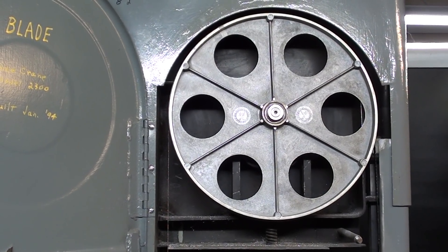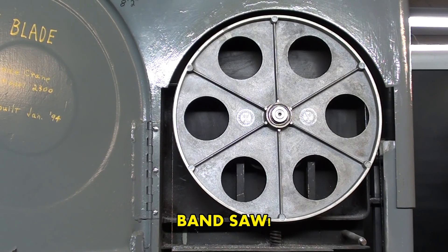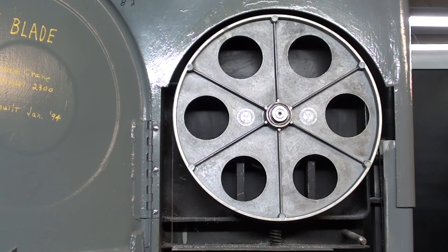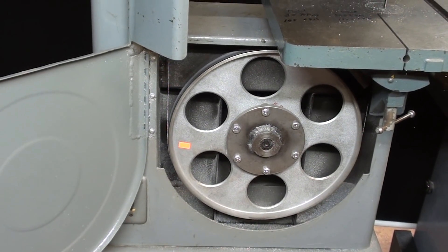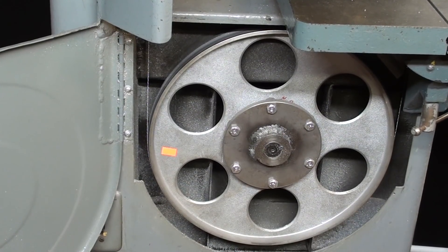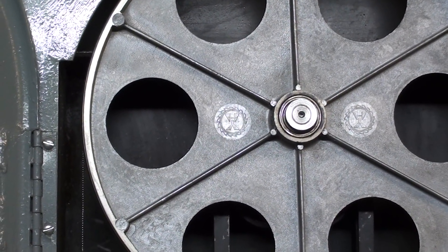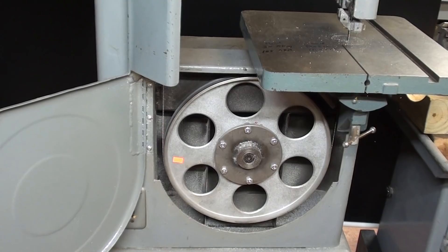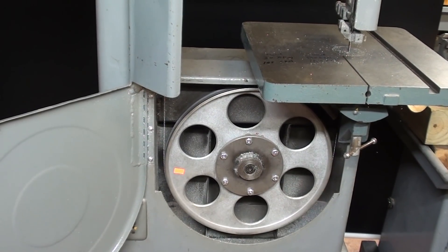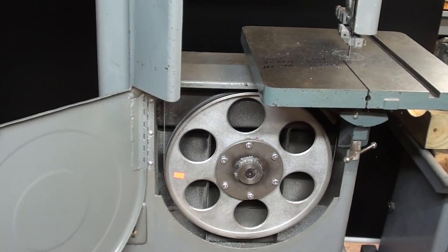I went to Menards. If you're not from the Midwest, Menards is something like Home Depot. I bought one of their knockoff 14-inch bandsaws for something like $200–$250, and I stripped it of the motor and the wheels. These are the aluminum wheels from that saw, and I had to adapt them — I built that flange and welded it on, trued it up, and changed the bearings. They already had the rubber tires on them. Then I took that motor and mounted it on this machine, and sold the rest of the carcass for parts — probably a hundred bucks. So that's how I got the wheels for this saw.